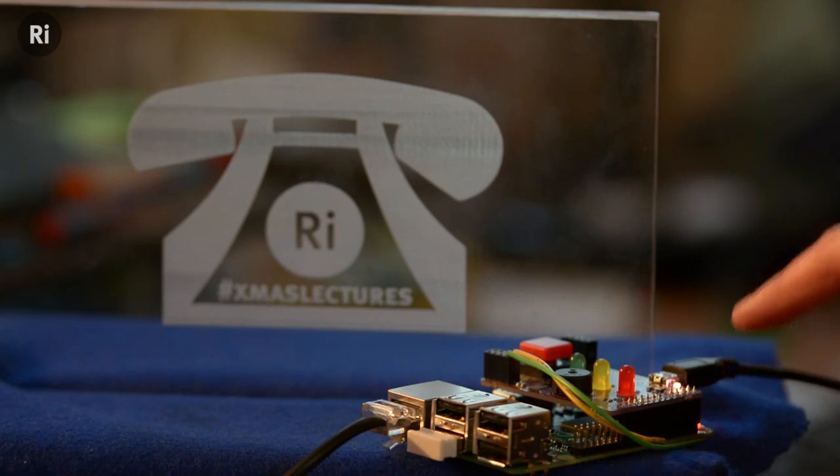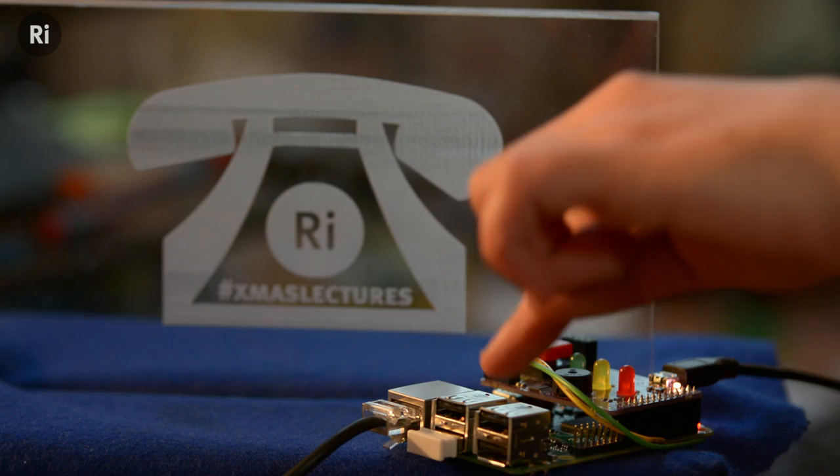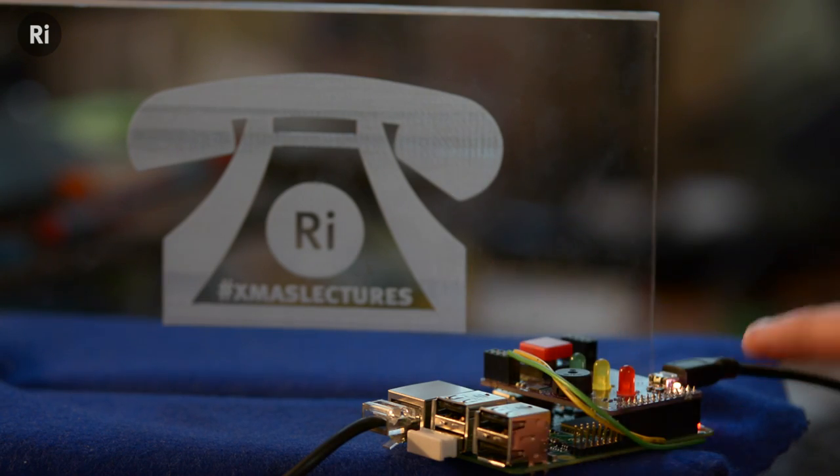So instead, I've put a shield on top of the Raspberry Pi — it clips onto the pins. The one I'm using is called a Pibrella. When I want to switch on the fairy lights, a signal will flow from the Raspberry Pi to the Pibrella, and then the Pibrella will turn on the fairy lights. That means the stronger current from the fairy lights will not be directly running through the Raspberry Pi, so it'll keep it nice and safe.